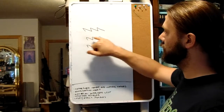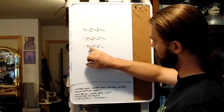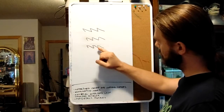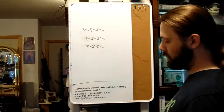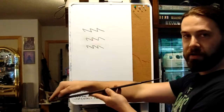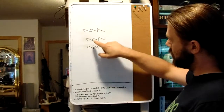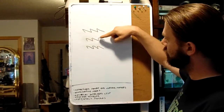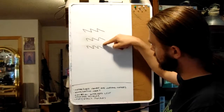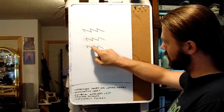Obviously that metal is gone at this point, so you're not going to get back to perfect. So what you're hoping for is this third drawing. As you can see, the teeth have been recut. They're not exactly like this, but they still have a cutting edge. And the way you do this is you take this file and you sandblast it away from the tang this way. Sandblast it backwards. What that does, it knocks off part of the teeth. It actually cuts away some of the metal. But because you're doing it backwards, the direction of the sandblast hitting it knocks the back of this tooth down more than the front, bringing this back to a sharp edge.